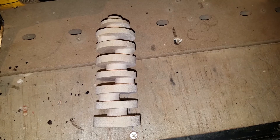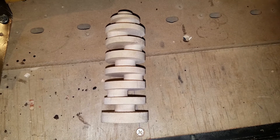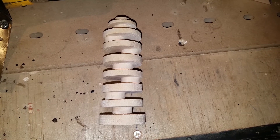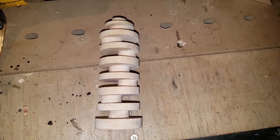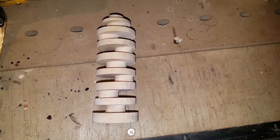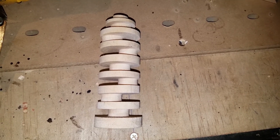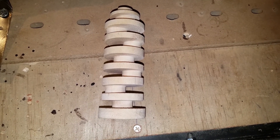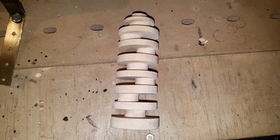I don't think I have any good reason not to be happy with this - the quality is really good, especially compared to the last one. Some of you might be intimidated because this seems like a big project and I used a CNC machine, but I wasn't actually using the computer function - I was just controlling it manually, so it was pretty much just a mill. My last one I made various jigs and used a router, and admittedly that was a lot more of a pain in terms of setup, but it was actually easier because it was a more solid fixture. You can do just as good without a CNC machine.